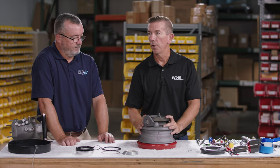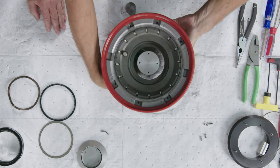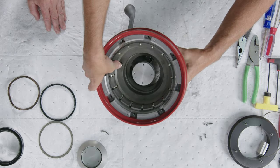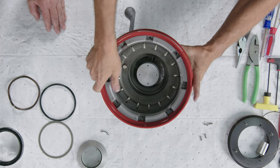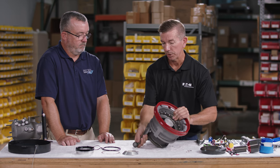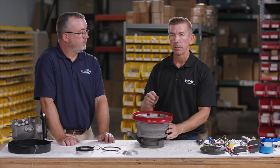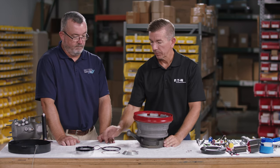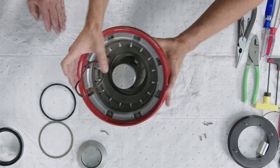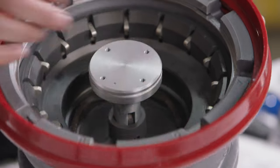To reinstall the nose seal, open the lower half by pushing the detent pin, pulling up on the outer collar, and rotating the operating handle to the open position to access the linkage. The first item to install is the wave spring — drop it into the cavity.